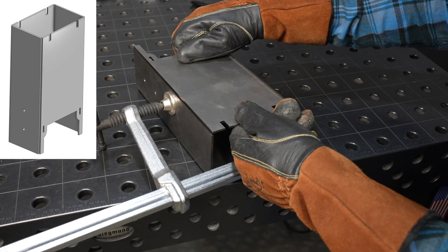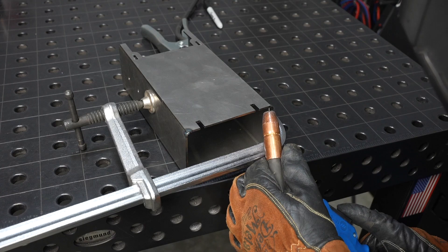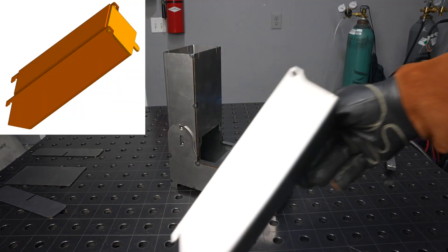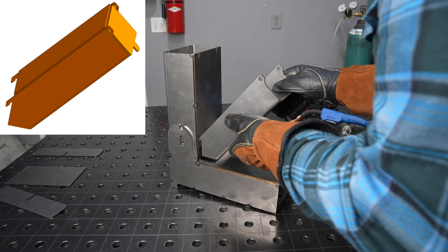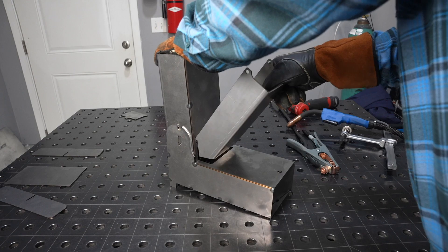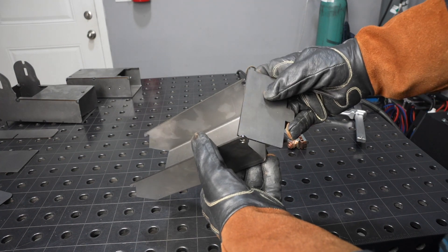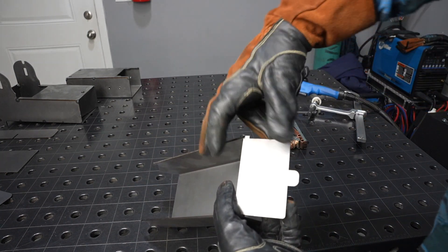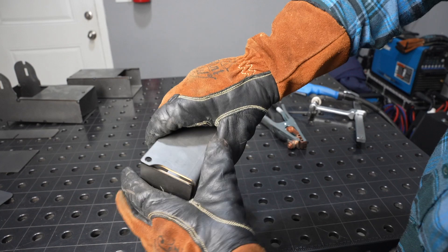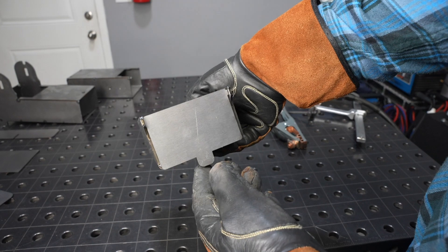I'll tack up the folding chimney. The last piece I need to tack together is the chute that will automatically feed the wood down into the firebox. It was a little snug fit — I think that's because there was slight springback — but once the top is welded on it should keep everything nice and straight. Before I put the top on I need to install this little lid to prevent too much air from being drawn in where the wood feeds, since I want the majority of air to come in through the bottom for a more efficient flame.